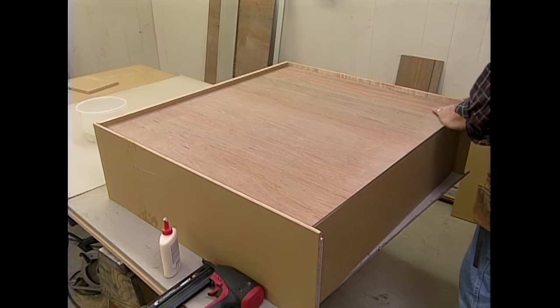Today I want to install this woodworking vise. But before I do that, I want to complete wrapping the edge — just using 2-1/2 inch pine with mitered corners. I'm going to set it in place with a pneumatic nailer. Before we use any power tools, let's talk about shop safety. Be sure to read, understand, and follow all the safety rules that come with your power tools. Knowing how to use your power tools properly will greatly reduce the risk of personal injury — and there is no more important safety rule than to wear these safety glasses. And just a little bit of glue on the miter, hold the piece flush with the masonite, and nail it in place with some 6-penny finish nails.